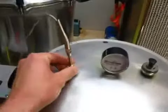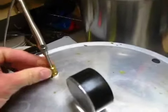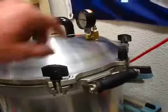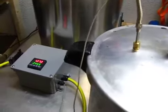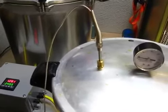I'm using a brass compression fitting where I removed the compression ring and put a high-temperature O-ring in. I'm switching it from one pressure cooker to another by just unscrewing it and screwing it into the other one. The nice part about having the O-ring instead of an actual brass compression fitting is you can slide it in and out to change the depth. That saves me from needing any quick disconnect on the wiring, which is just another way to fail — you could get false readings or an open connection from corrosion. This is probably the best way to swap the probe between the two pressure cookers.